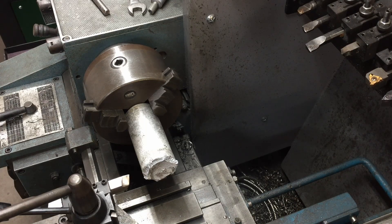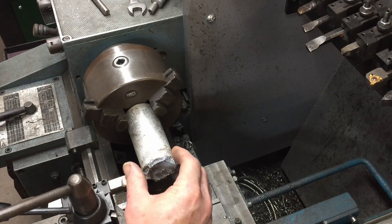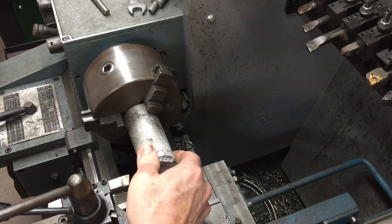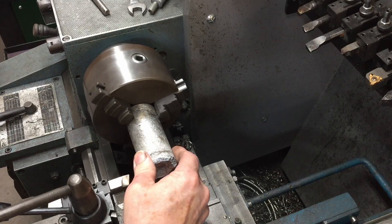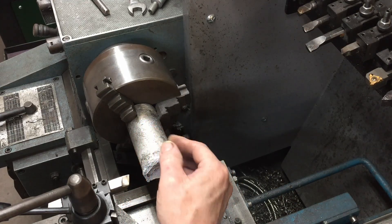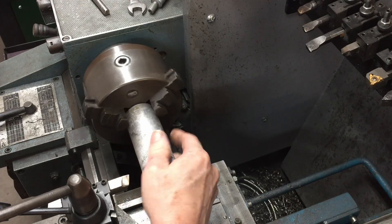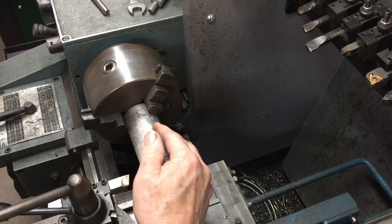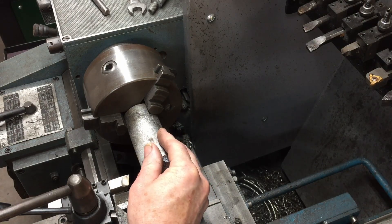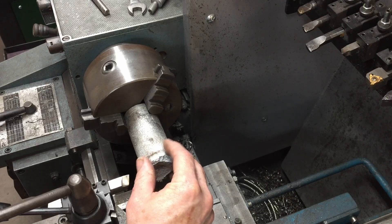For the smaller mold, one casting was done with a cold mold and the other with a warm mold. I've marked the heated mold piece over on the bench. I can tell straight away this one is the non-heated mold piece - it feels rougher, more pitted, with small holes. The finish on the heated mold piece seemed a lot better. Anyway, I'll turn it up and see what's under the outer surface.